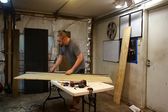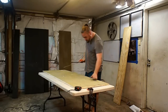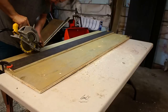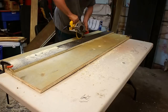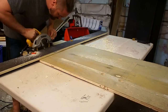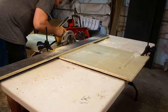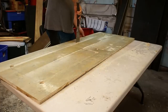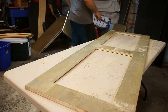After I had all the radiuses of the corners done, it was time to go back and mark again and join the very outside edges to connect them. I'm putting down a fence the same way I did to cut the long pieces. Now if you aren't comfortable with this next technique, certainly do not use it — plunge cuts are a little more advanced. You could also use a jigsaw, though I find the edges aren't exactly at 90 degrees with that approach. With the circular saw you have to be careful not to cut all the way through to the radius on the other side, so I came back and used a handsaw to finish up the cuts — otherwise you'll go too far on one side and not far enough on the other and end up with an ugly line.